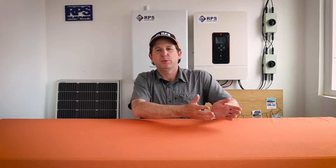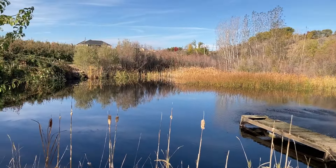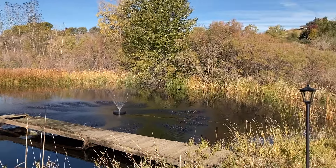You can also pump out of another water source like a pond or a lake, where we run a suction line and a foot valve up to a surface pump. Those surface pumps are capable of 10 to 20 vertical feet of suction, so we can draw water out of a pond, lake, or tank and pump it to where we need to go — whether that's sprinklers or a pressurized system.